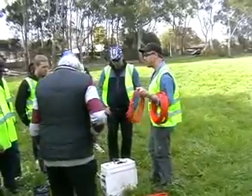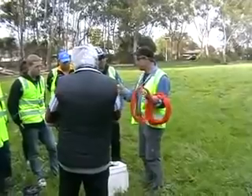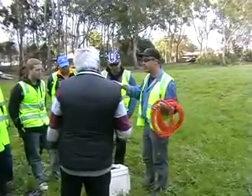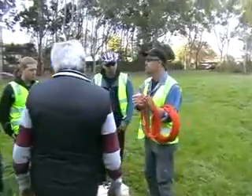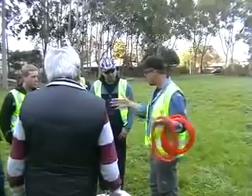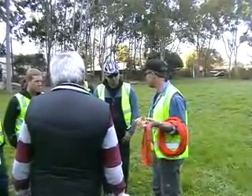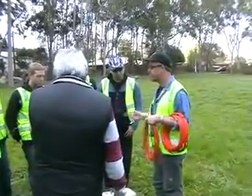The loop we're making — getting the area right is critical. If I make it too circular, I've got something that's too big. If I make it a parallelogram, it's too small. All of a sudden I can start making my magnetic field wrong by 5 or 10 percent, and I've created anomalies because I haven't made good squares.